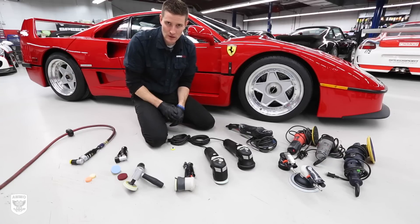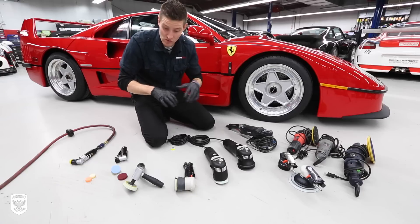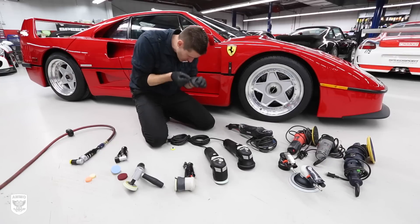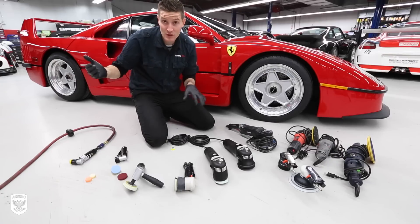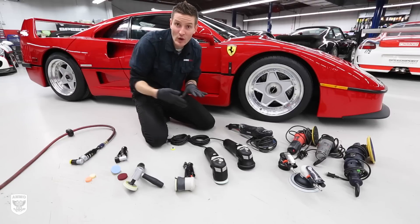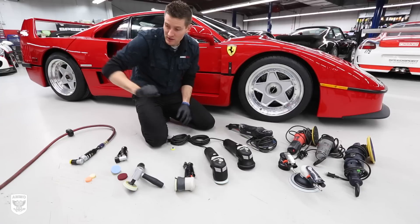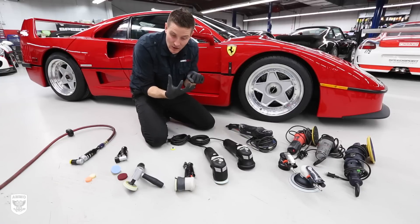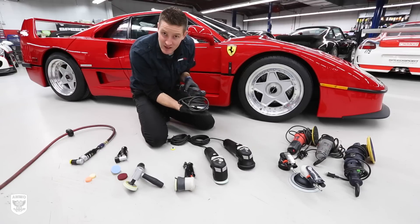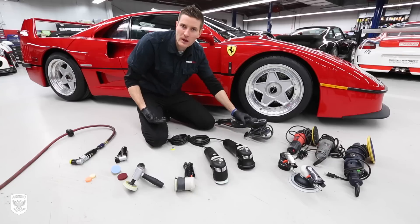Let me use a very short example that has nothing to do with cars. If you're sanding a slab of stone, you're sitting there grinding and the stone is all coming up. If you see a professional guy doing it, he's got a tube that shoots water in there to push the residue away. Take the hose away and he's grinding - all those little rocks get into the bottom of the machine where the pad is touching the stone, and it causes more scratches.